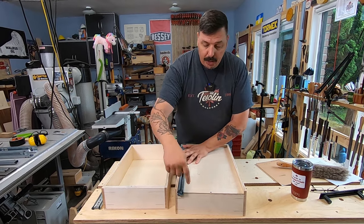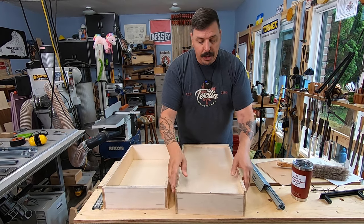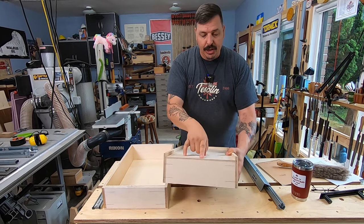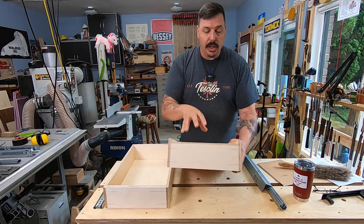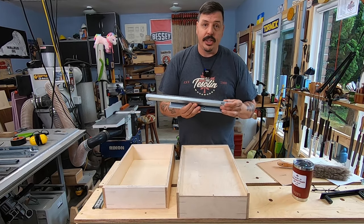Now some people put a groove all the way around and then cut a little notch out of the back, but I've always made drawers where I basically do run the groove but then rip that piece right off and just secure the drawer in place with a screw. This is a really simple way to build and it gives you a nice solid bottom that will rest perfectly on this slide.